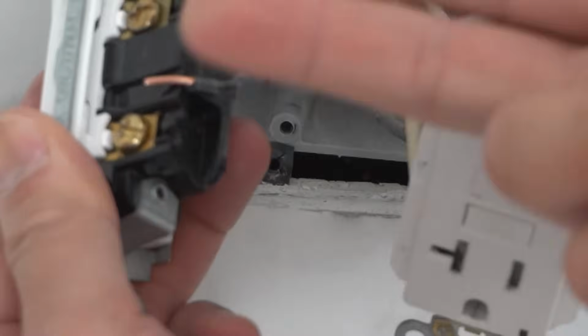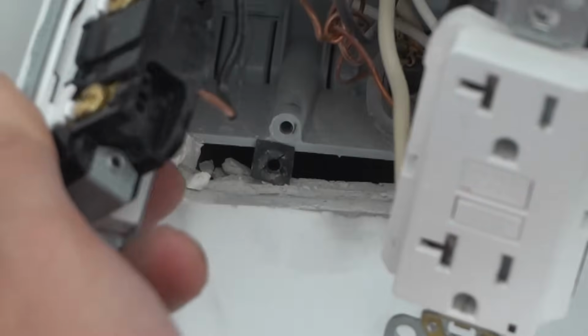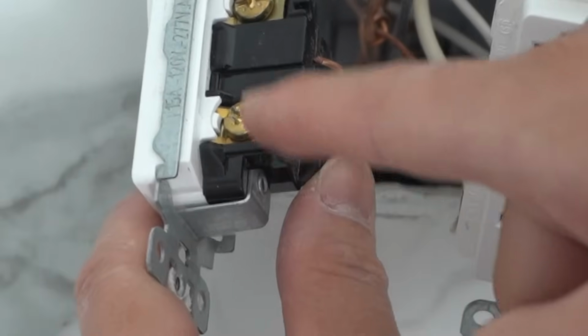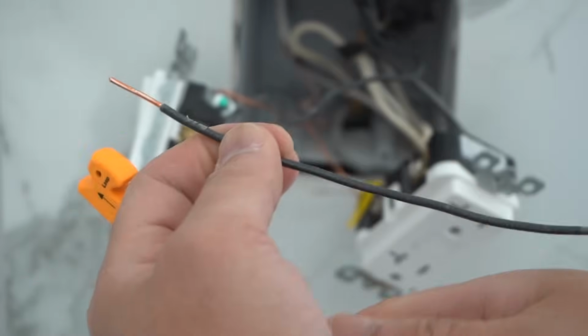And you're having, oh there, that's a perfect example, especially this hot wire, and you're gonna have sparks and possibly cause a fire. Best way you can do, an option, you can do the back wire, or just do the old-fashioned way and just connect it with the screw-in terminals. So here's my pigtail. This is about 6 to 8 inches, depending on what you need.